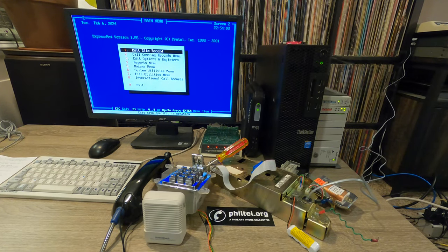This thin client I actually got from eBay. You can get them for about $50 in their base configuration. I actually paid closer to $100 for this one because the seller did all the work to upgrade the RAM, upgrade the disk on module, do the dual boot installation, and track down and install all the drivers. Even when you part it out, for the thin client, the memory, and the disk upgrade, it's well worth it to just get somebody to do the installation and driver hunting for you. I think it was only a delta of like $10 or something, so definitely worth it. You can go that route, but you can also get these for about $50 or less.